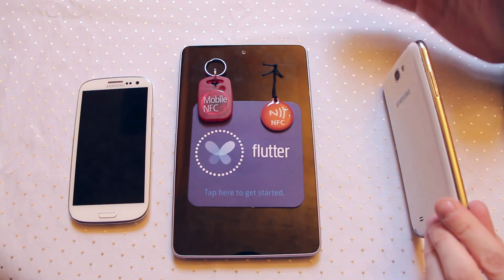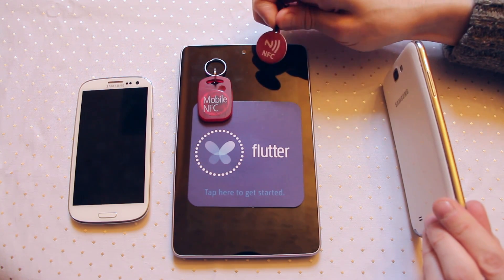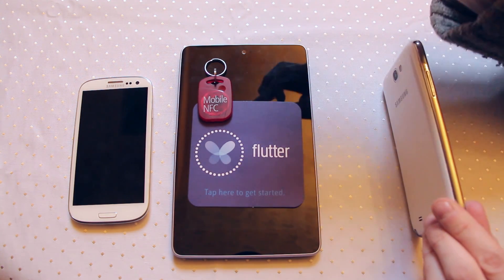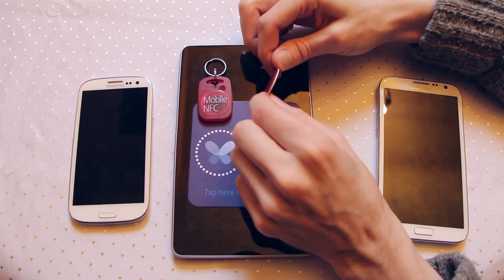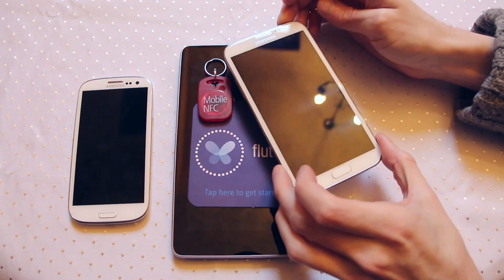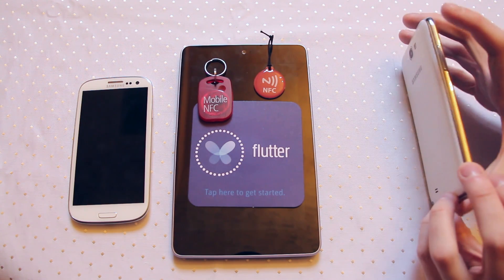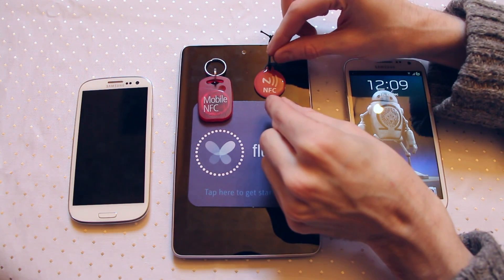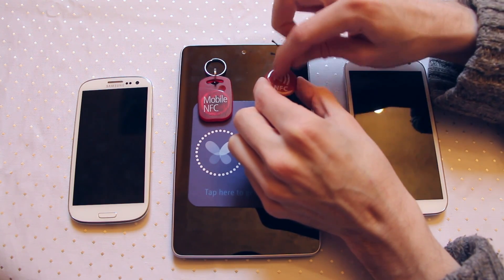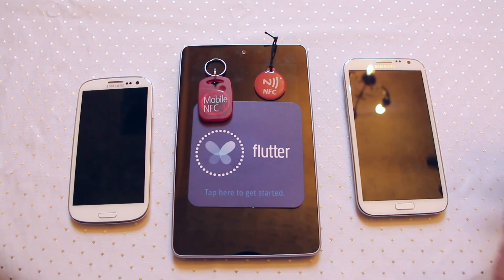It's not harmful to humans or animals. It's very low power and only has a very short range. An NFC-equipped chip can be placed near the back of the reading device and the phone will actually power this little chip. Inside there is no battery — it is purely an antenna and in the centre a very small chip which can store information. When we pass our NFC mobile device across the chip, the electromagnetic field extends just far enough to power up the chip inside, and the antenna then allows the information to be beamed back and read by your main device. At that point the information is revealed.